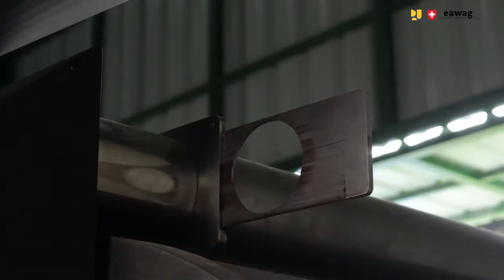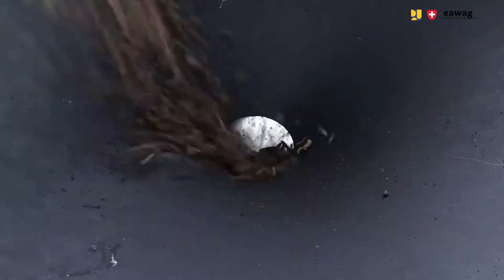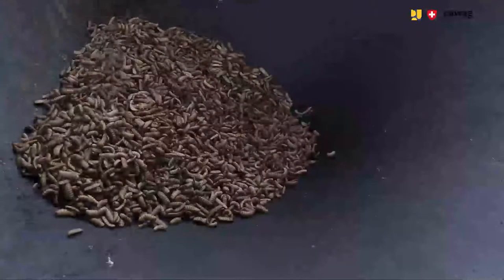The exhaust fan can be fully open, closed, or half open. You have a slider for that. We recommend leaving the exhaust fan half open throughout the whole running time. When the drum reaches 140 degrees, which you will see by checking the control panel, you can add the larvae